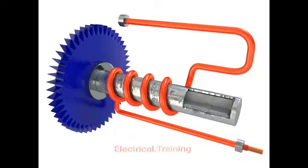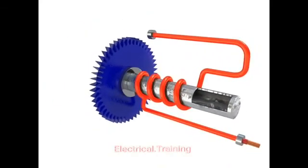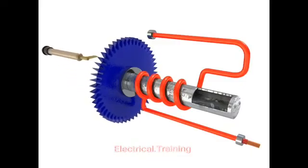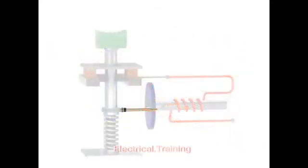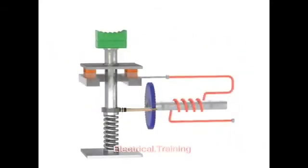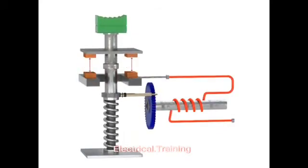At the elevated temperature, the alloy will instantly turn from a solid to a liquid, allowing the inner ratchet shaft to turn freely. When the wheel turns, it releases a pawl previously engaged in one of the cogs of the ratchet wheel. This pawl is connected to a spring-loaded contact fixture, such that when the pawl trips, the contacts automatically open and stop the current flowing to the motor starter.